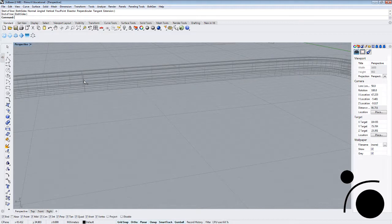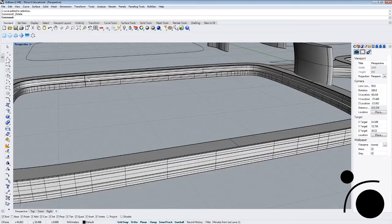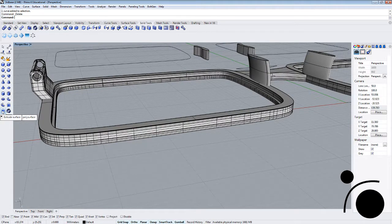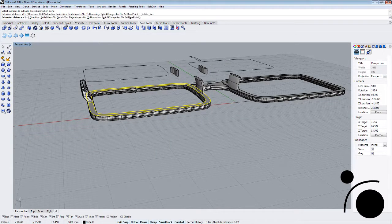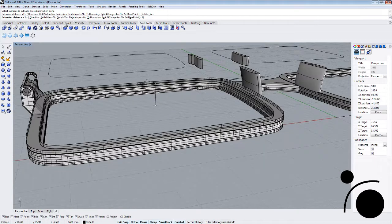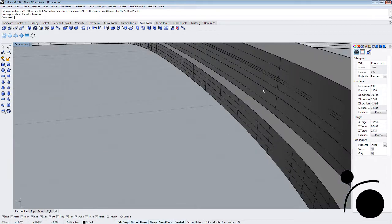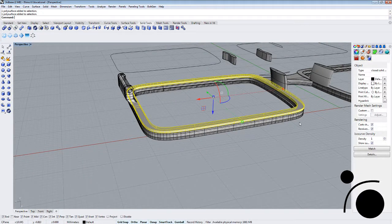So that's saying it's 0.6 millimeters just for that little segment. And that seems like probably a decent amount. I'll just go up that amount again. So to do that, I'll go to my solid tools. I will select a surface. I'm going to select this surface, and we're going to go up 0.6. I'm in millimeter system. Actually, I want to make sure it flips solid. Yes, not both sides. Perfect. We're good. So that's significantly deeper now. You know, we're intruding into this geometry. And again, I'll mirror this whenever I get to the other side.